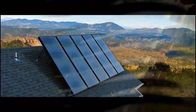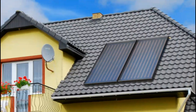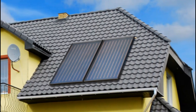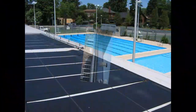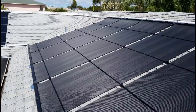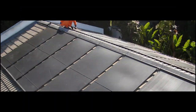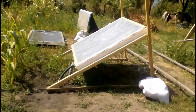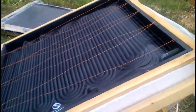Third, we know that these expensive flat plate solar collectors are able to withstand high temperatures of about 200 degrees Celsius during their stagnation. But it is obvious that the polymers of these pool heaters can be destroyed by the high temperature of their stagnation under a glass sheet or other transparent covering. Therefore, they require such experiments, which have already been done by me for cases of the stagnation of that Chinese heater under transparent film.